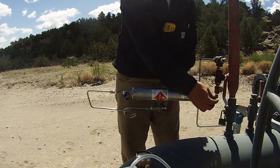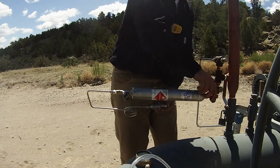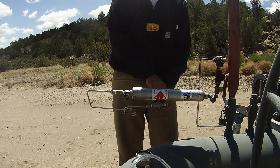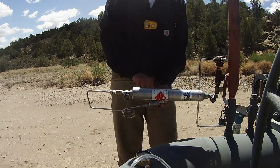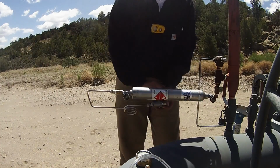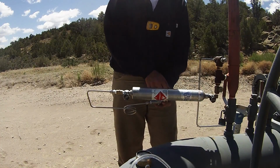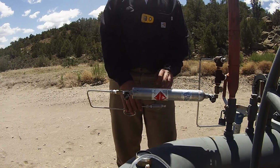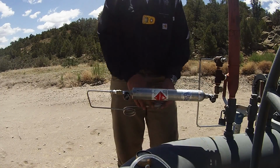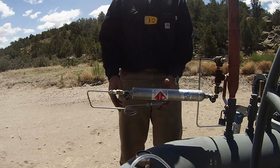The purge cycle is dictated by the pressure. And with this, I do believe it is 4 purge cycles for this pressure. There's purge cycle number 2. Purge cycle number 3. On the end of this valve, we do have a restriction to slow the gas down and not let any air back into the system.